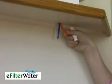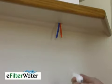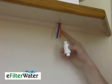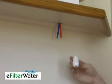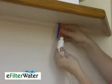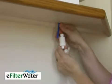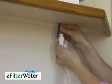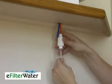The orange line is the water intake valve — this is what comes from your cold water line. The blue is the dirty water, the return water that's going to go to your drain pipe. You will receive a connector — the larger one is a flow regulator. This needs to go on the orange line so that if you ever have a surge in water in your line, it doesn't affect the unit. There's an arrow indicating it points up. Go ahead and put it on the orange line, push it in, push a little bit more and you'll feel it go in just a tad bit more — that's how you know it's sealed. Give it a little tug and you're good. Take the other end going to the cold water line and do the same thing. Same process with the other connector.